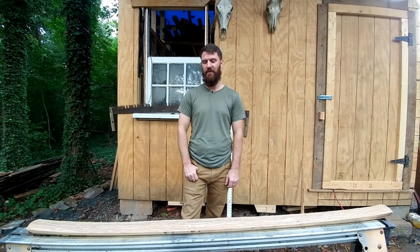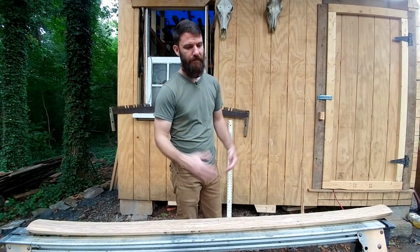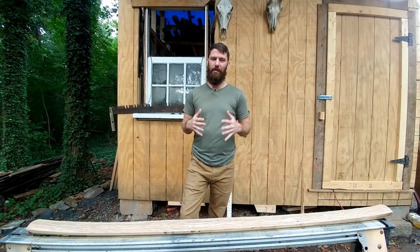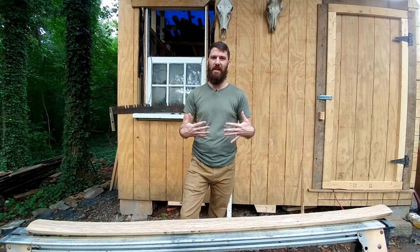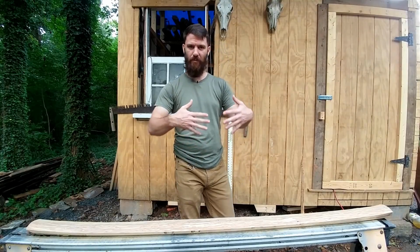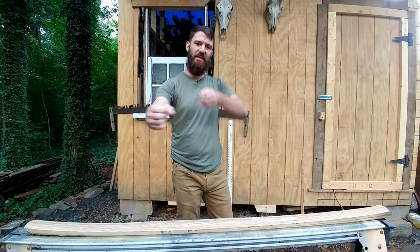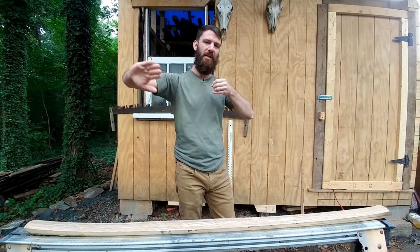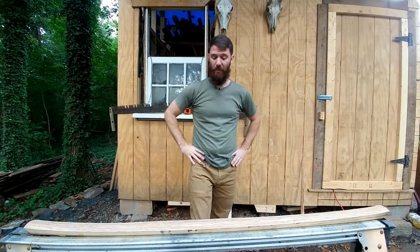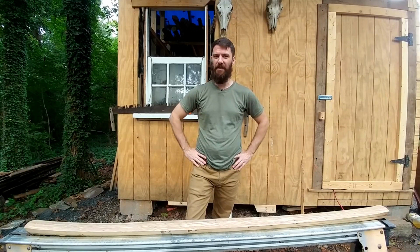One of the other important qualities for a good bow wood is compression. And compression is the ability for wood to get bent and then spring back into shape without having the cells get crushed and retain the bend. And that happens on the belly of the bow, the part that's facing you. The back of the bow is what does the tension work, and the belly is what does the compression work. And hickory and other white woods tend to be not that great in compression.